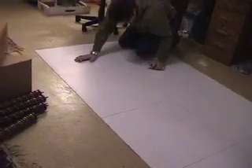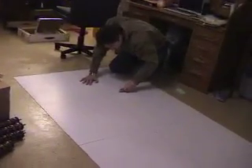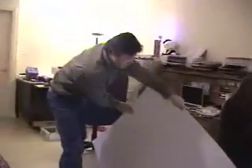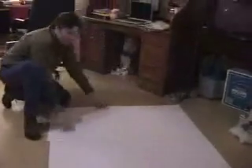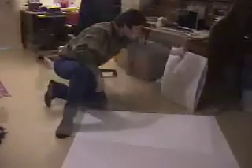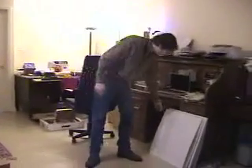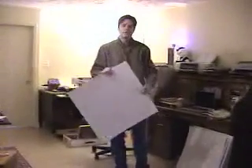This is the material that Bill sent me. We're going to pull Bill some forearms and some hand grips. You're going to hear a loud noise and that's going to be the plastic breaking. There's our two-foot squares. The old score and snap technique. We now have the two-foot square material that we can load into our Vacuform machine. Let's go fire up the Vacuform machine.